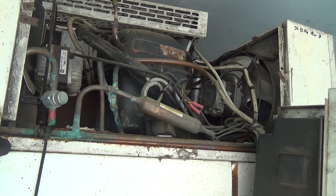I've gone for a wall-mounted evaporator again, because they hang deer in the room — it's quite a small room. If we put a normal ceiling-mounted unit, we'd take up too much space; the room's only this big. Whereas with a wall-mounted unit, it's pretty much flush inside, so they can go nearly within a foot or so of the back wall.